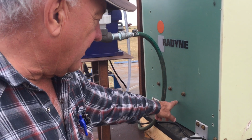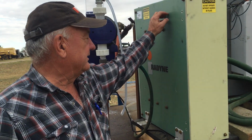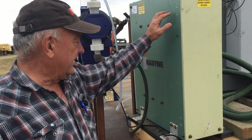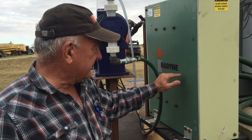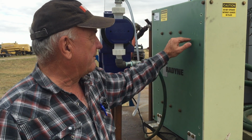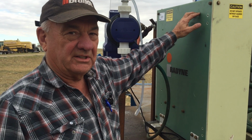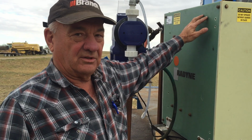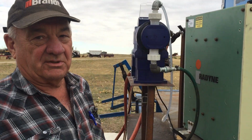Yeah, the water comes in the bottom, and we got 13 pipes that go like this, and then as it comes out, we'll make steam anywhere in here that we want to. It just depends how much power, how much water we put in. So if we make steam here halfway through, then it's got another 6 1-foot pipes to go through, which can create more pressure or more saturation depending on how it's controlled. And then when it comes out, it's saturated steam.